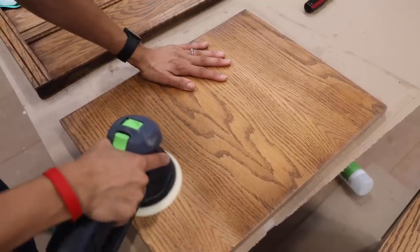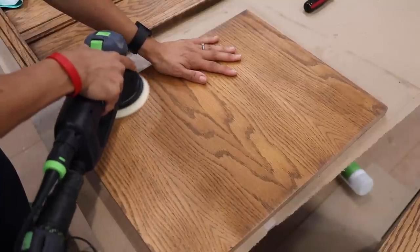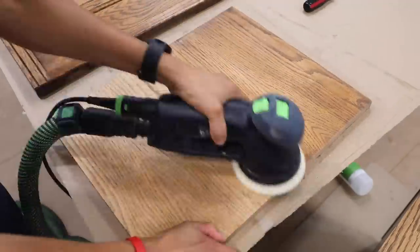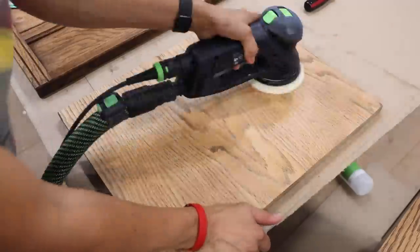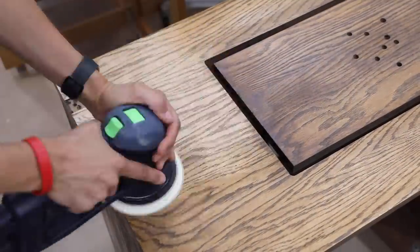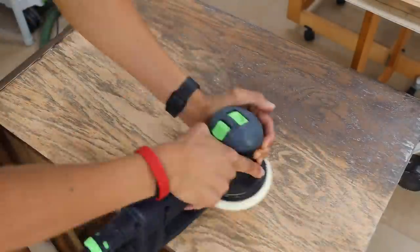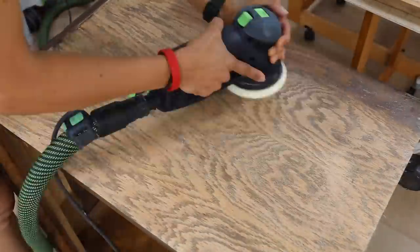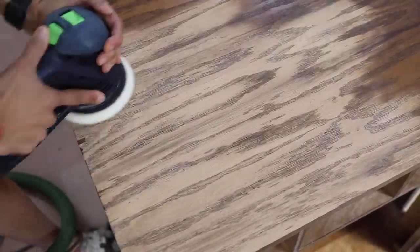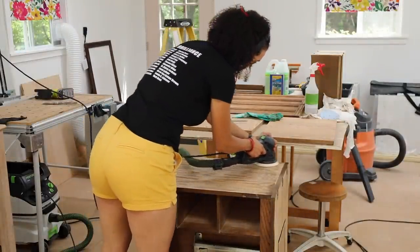Once my wood was clean, it was time to go over it with the orbital sander. I love sanding wood before I stain it. Some professionals say you may not even have to sand it, but I love sanding it because you see it does a pretty good job of getting it back to as raw of wood as possible. Once I did that, I knew that whatever color stain I was putting on would not be interfering with whatever color was underneath from the existing stain. And if you don't want to use chemical stripper, you can actually just use an orbital sander — it'll take a little bit longer because you're going through multiple layers, but it's possible. Just make sure that you're using a mask and wipe down all the sawdust before you're ready to move on to the next step.